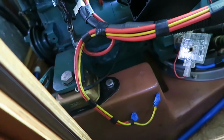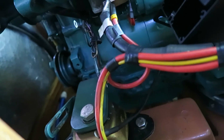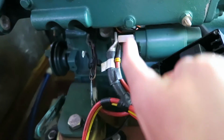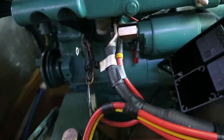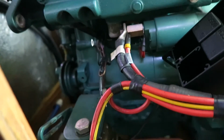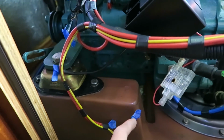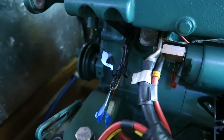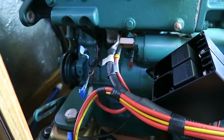I have of course put away the wires here, and I will of course check to see if there are any wires that have some power on them before I do anything. But I know this one here is also a wire with some 12 volts. So I will keep all the other wires far away from that. I have put on some electrical tape on all the naked connections, so I am sure that nothing touches where it must not.